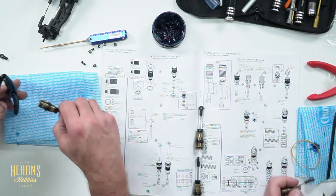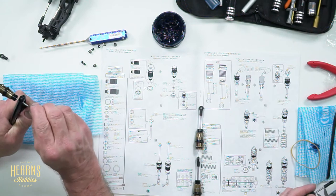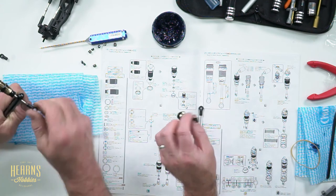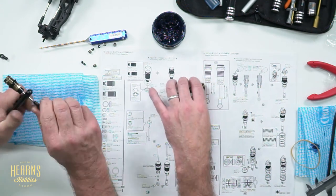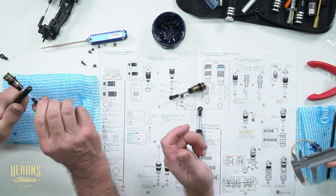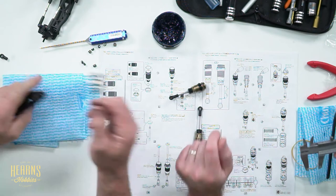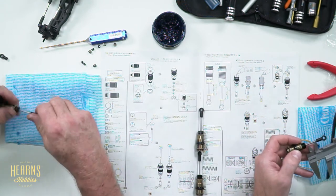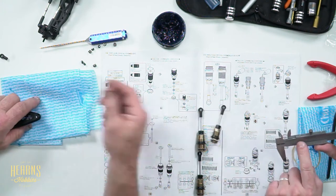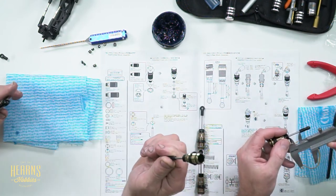Come on. Chop, chop. What is it? Closer to 23? 22.3. How can you tell? Let's go a quarter of a turn, mate. You can tell 0.3. You read the top scale here, whichever one lines up, that's how you read a vernier, mate. That's probably why I have a digital one. So, in or out? In a quarter.